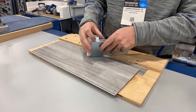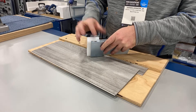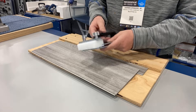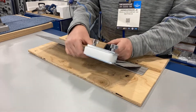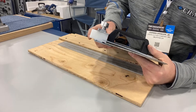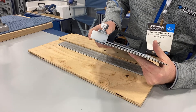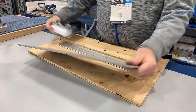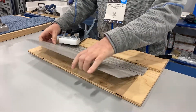We select shims that we think are appropriate and build a profile through a little trial and error — it takes maybe 30 seconds, very quick to do. Once you've built that profile, you can see that I'm not on the tongue and I'm not on the wear layer. I'm protecting the brittle parts of the material. So let's install this piece.